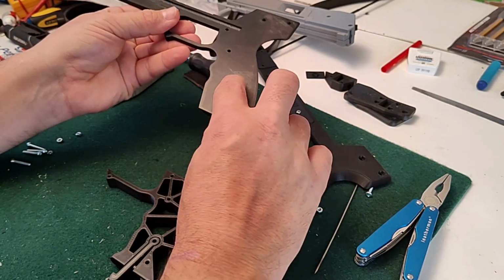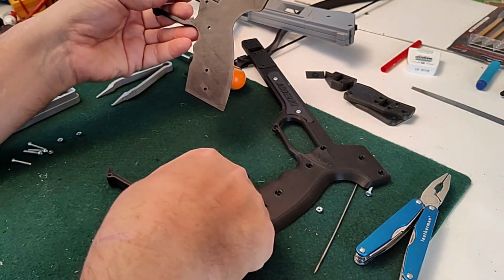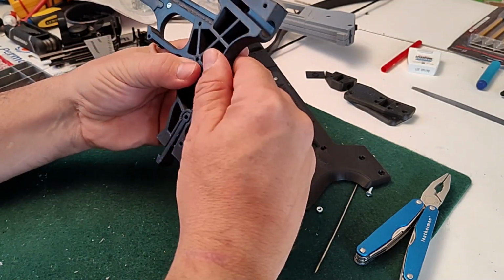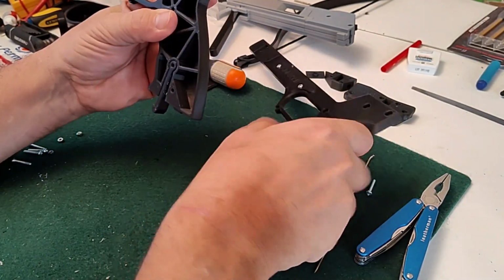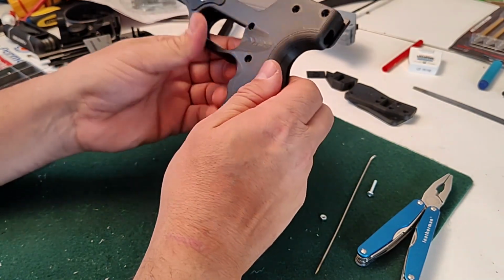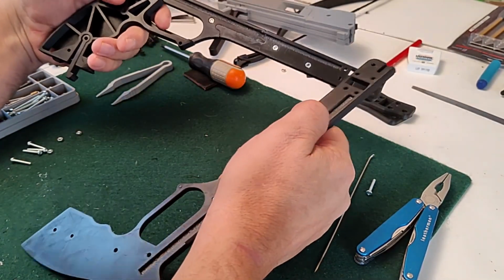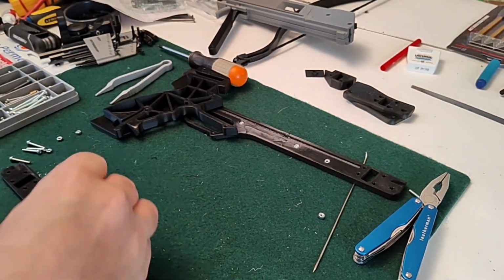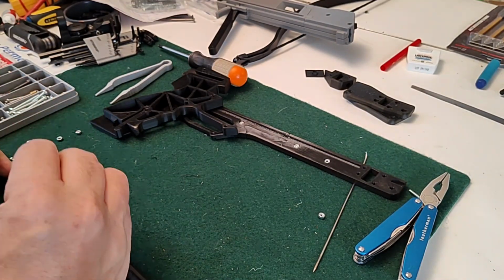And once again, frankly, it's a little dumb to me that that's not a through hole with a nut on it. Because it makes it very difficult to set that one up as the first nut, which is what you want, so that the catch is held in place and can't float around in there. And every time, these things are going to fall out, which is, frankly, super annoying. And the way around that is just put a little super glue in the hole.